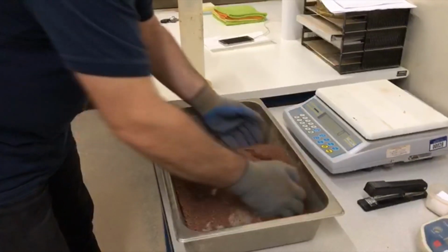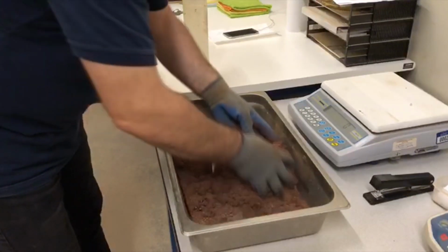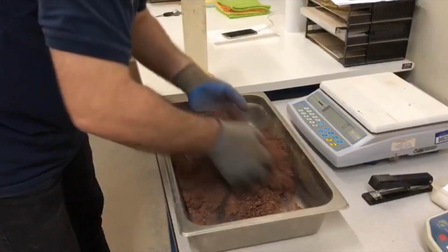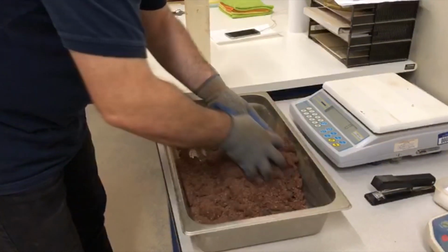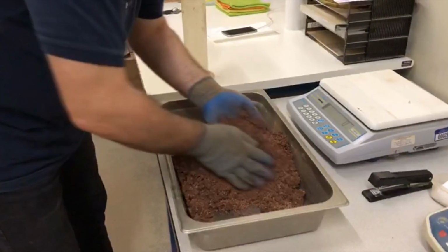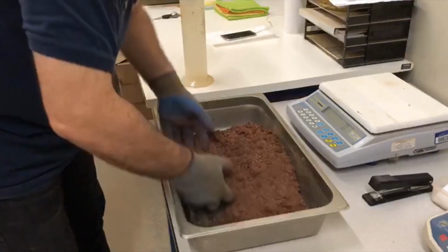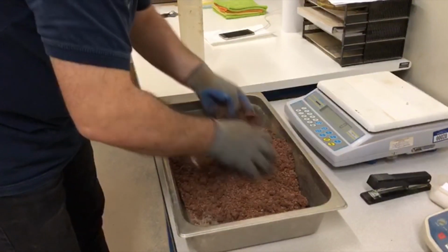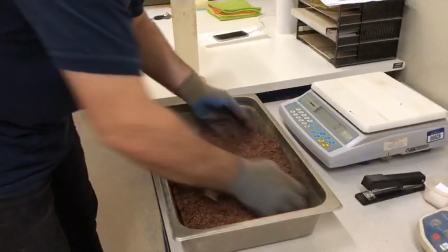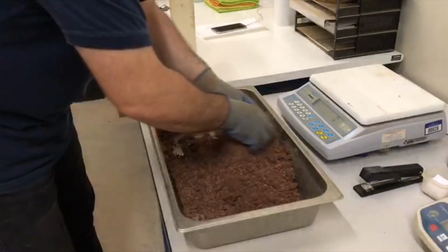Ensure that your soil sample is not too dry or too wet. For the best results, it's recommended to prepare the soil sample approximately 1 to 3% drier than visual optimum moisture. If your sample is too wet, you need to dry it before the test, and if it's too dry, you need to add some water to get it as close as possible to the optimum moisture. In this case, our sample was too dry, so we added water and mixed it well before running the test.